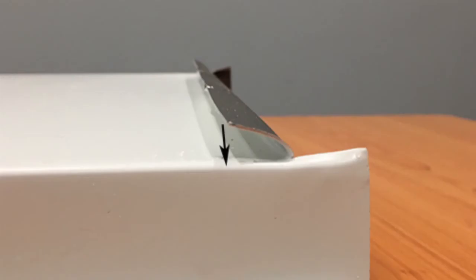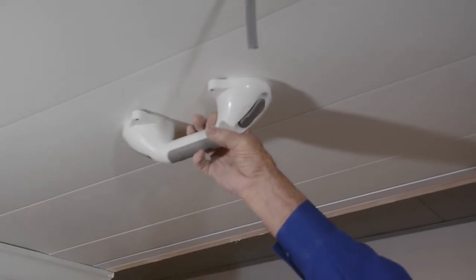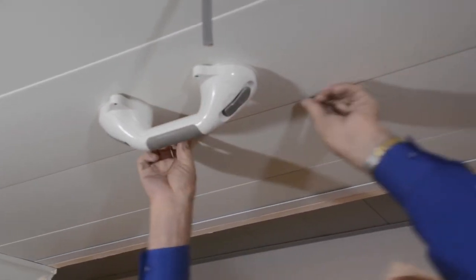Replace a panel. Restore the end of the panel that grips the gutter so that the gap is again 1/4 to 3/8 inch. Rest the flat side of the panel on the gutter. Slide the panel in so that it can be inserted into the back wall channel. Slide the panel toward the back wall channel briskly until the panel engages the gutter. Lift the two adjacent panels together until the panel latch engages.